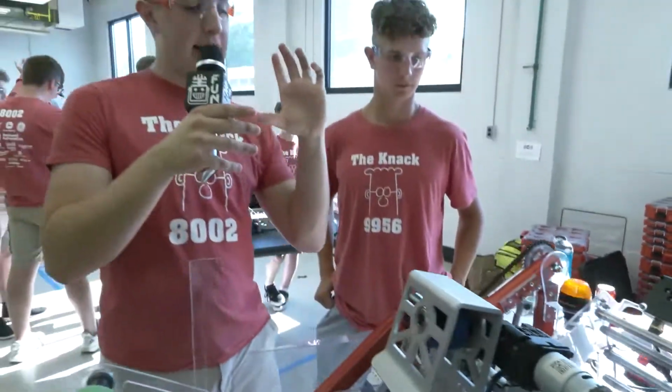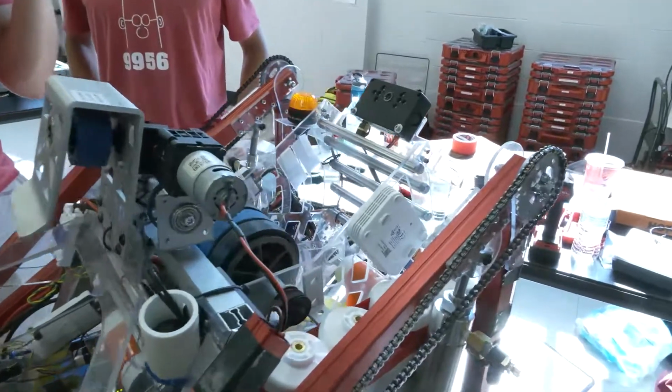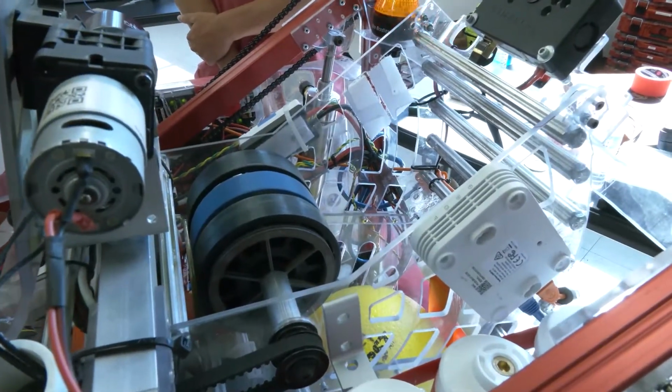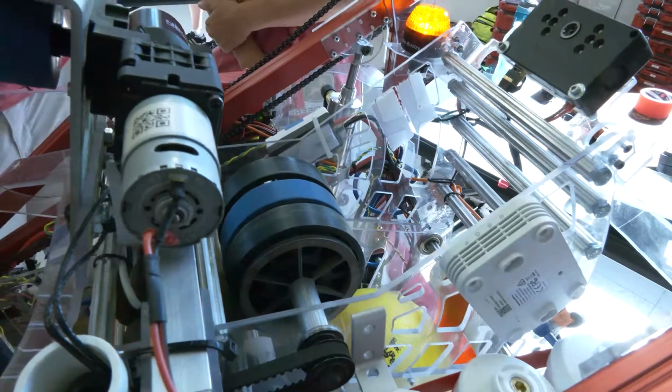There's a bunch of discs that have the really high inertia mass on the outside. They were all laser cut, and we've kind of been playing in and out. It changes depending on the competition, and especially this season, as opposed to last season, the balls have gotten squishier as they've sat over time. Yeah. So you have to adjust the weights and your speeds and feeds.